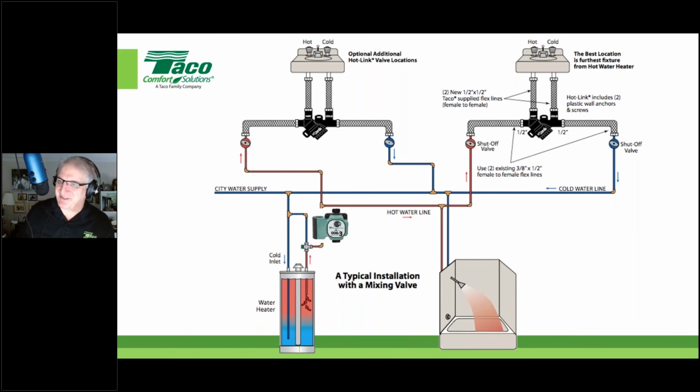You don't have to upsize the pipe, because it's kind of like sizing a pump for a zone valve application. It's the same thing, right? It's not cumulative pressure loss. It's just whatever the worst case one is. So yeah, you can do up to six in your different fixture groups. Absolutely. Brilliant question, my man.